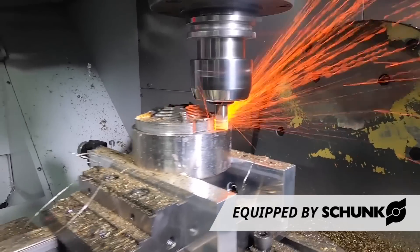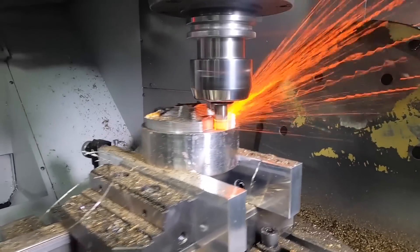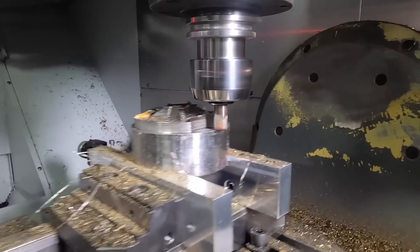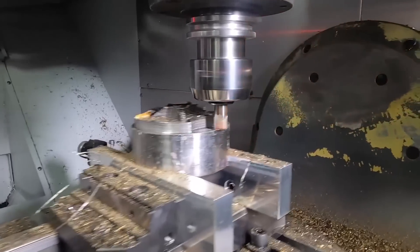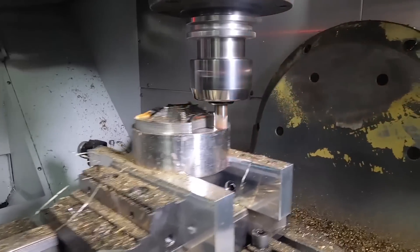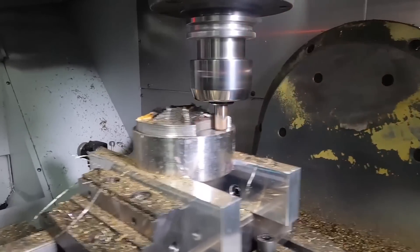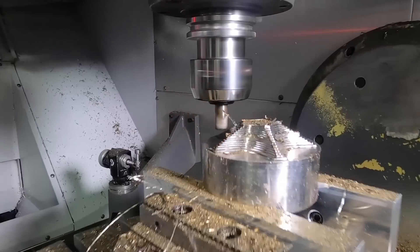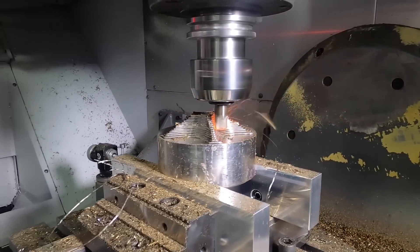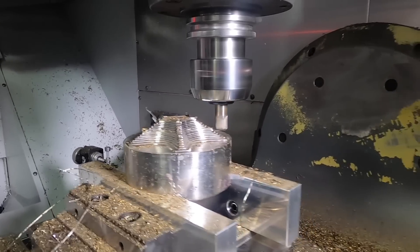The Harvey 3 is a crazy tool. You can take a three-quarter inch tool and drop down four inches in titanium or Inconel and it'll handle it. It won't go as fast as ceramics, but it will last long. When it comes to both types of tools, make sure you have a good understanding of your application and choose wisely. This has been a crazy test — the tool looks amazing. We're over 12 minutes of nonstop cutting and you can't even hear a difference. It sounds so good.